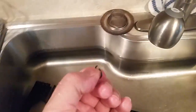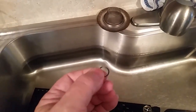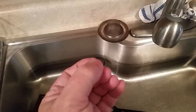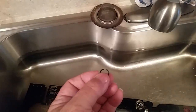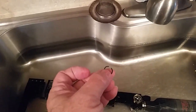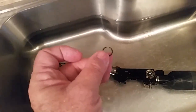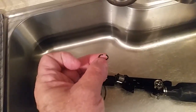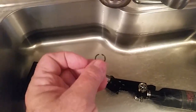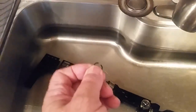Now, this is supposed to be a Buna 90, fairly hard rubber, but not as hard as this. This feels like a little ring of steel. It's rock hard and very brittle. So it was either a bad O-ring from the beginning or just degraded over the time that the guy owned this rifle. Nevertheless, that's the offending O-ring, 10 by 1.5.